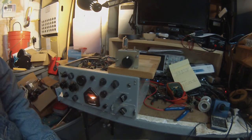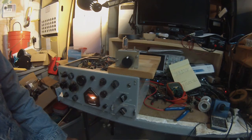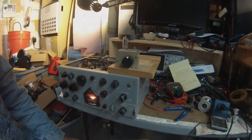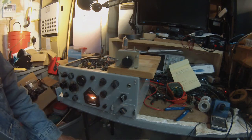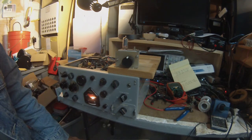This still has an interesting problem. It was dead for months and I couldn't figure out what was wrong. I accidentally touched something and shorted it to ground and it came to life. There are four tubes that on receive are grounded and on transmit are biased with negative voltage to cut them off. I think what I did was accidentally short the bias. But I'm still tracing the grounds — even some tubes still have bias on them that shouldn't. The S-meter doesn't work, although you can zero it, so the meter itself is okay. There's something wrong in the AVC and something wrong with the grounding in the relay. I took a relay out of the junker and I'm going to swap it in.